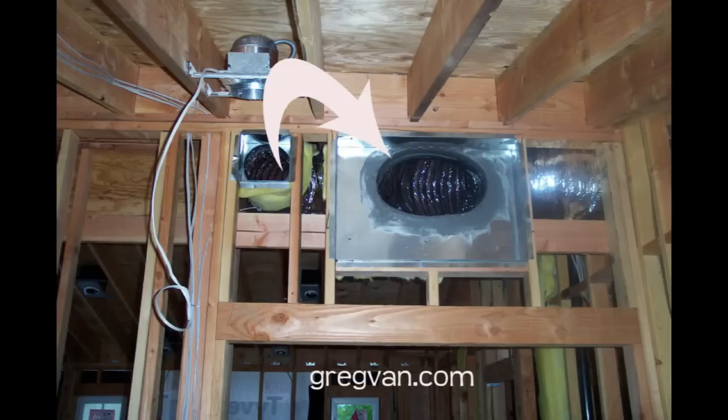Now, both of these ducts are on the same side of the forced air unit — they are either both supplying the room with cool or warm air, or they are both sucking the air out and sending it through the forced air unit. You may run into a case where the structural engineer will not allow a large return air grill in the wall, because they don't want you cutting out too many structural framing members: the studs, posts, rafters, stuff like that. So this could actually be two supply-side ducts supplying the room, or two return ducts pulling air out.